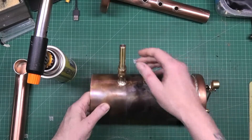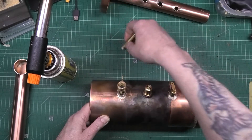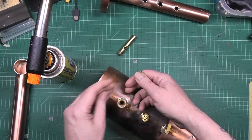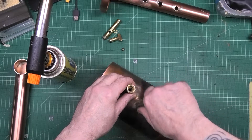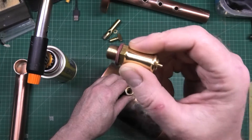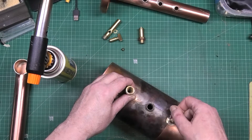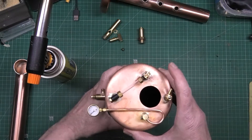On the top we have the whistle, which all comes off for soldering. I've got to get all this off anyway to finalize and button the end up — so there are the whistle components. Then we have the pressure relief valve — all these threads need cleaning as well. The pressure relief valve has a fibre washer on it. And then we have basically the throttle. I'm not happy with this one — I might put something else in its place.